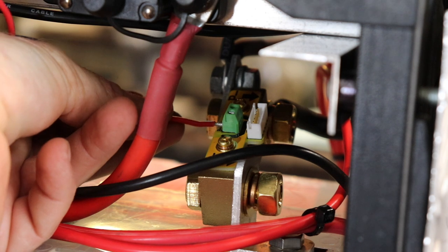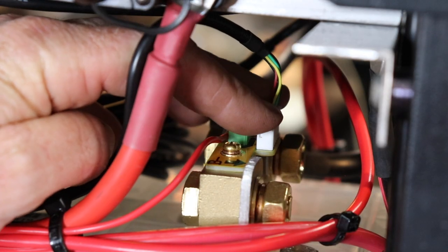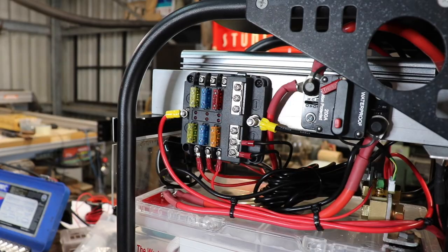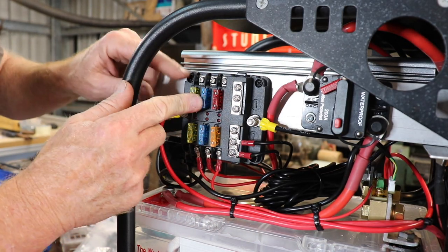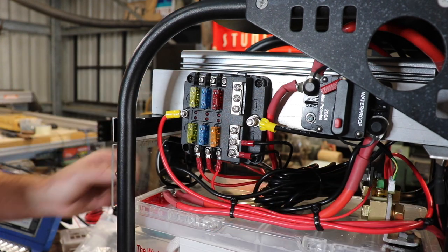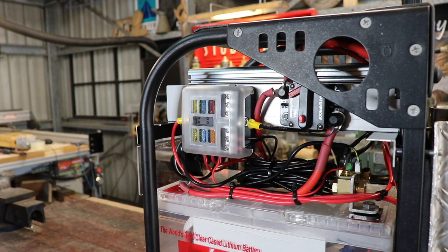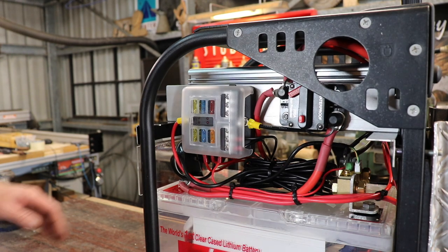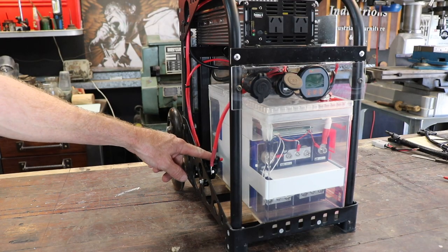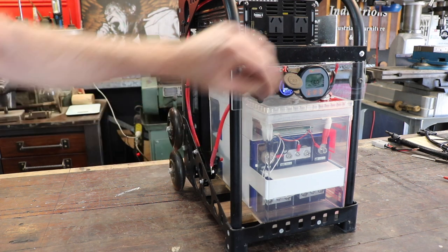I've just got to hook up the power supply for the battery monitor and that goes to the shunt via a little terminal block. I think we're all done. The last thing I'm going to do is just check everything's all tight — I don't want any loose connectors where they can create a hot spot. I'll just spend a couple of minutes doing that. Let's turn a few things on here. This big breaker will power the whole unit, and the breaker on this side here will power the front and the battery monitors. Let's turn it on.